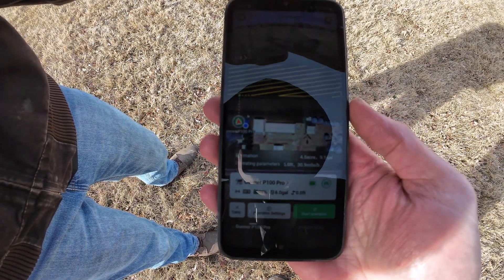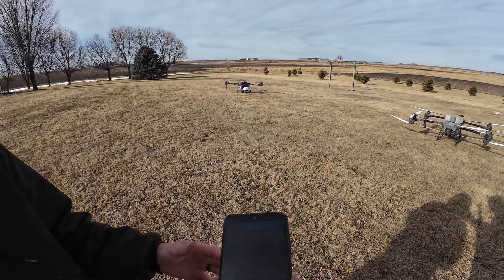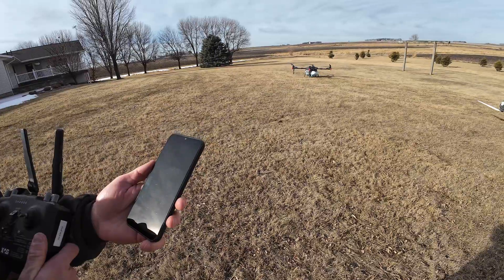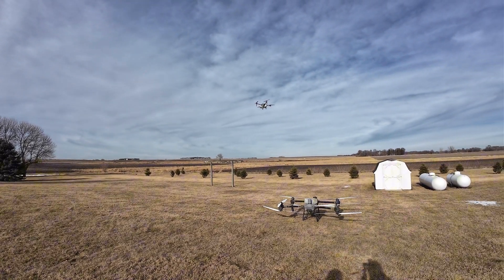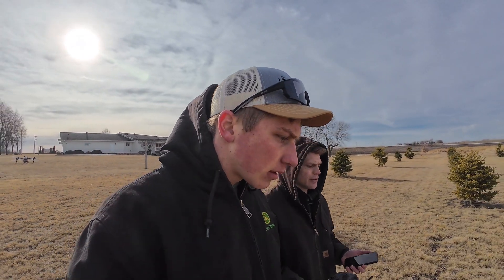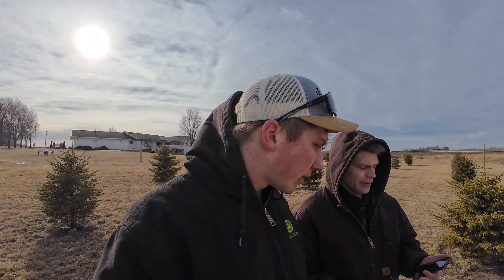Here's what the phone is seeing for the XAG drone — there's the camera looking at 90 degrees and the flight path we're going to take. Zane's about to take off autonomously by swiping on the phone. Hit start operation, do your checks, make sure everything's unfolded, swipe and it uploads. At any moment I can always take over. You can set how high it is above the crop — this is 15 feet, same as before. Fully autonomous, going 30 miles per hour, spraying out some water. A notable difference is the entry point — you can set an entry and exit point, so if there's something in the way it won't just beeline through it.